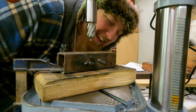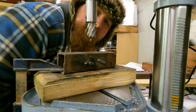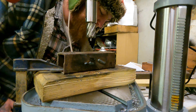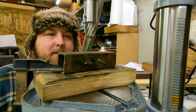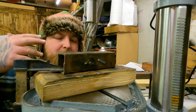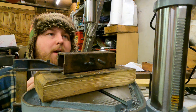I'm just going to debunk something for you right here, right now. This is an annular cutter - you generally find them in mag drills or milling machines, and the reason being is because they're precise. Now these annular cutters, although mag drills only come at one speed generally, you've got to get the right speed and with them you've got to keep a constant pressure.